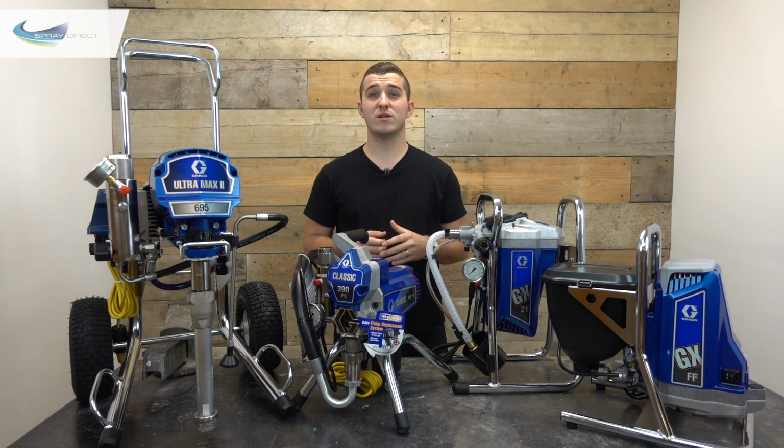In my example, I said once a month on average I'm going to need to spray 2 new build houses. So this isn't what I'm doing all day every day, it's just every now and then, so when we're speccing a pump we don't need to go over the top. So for this example, I'd be going for a pump capable of somewhere between 23 and 25 thou. So that's the Graco 395, Tritec T4 or the Graco 495.